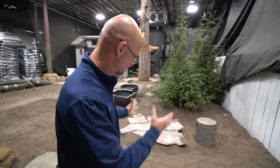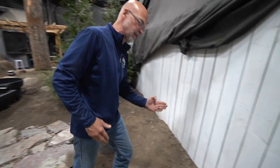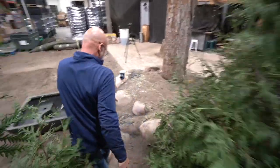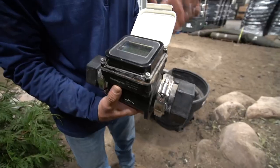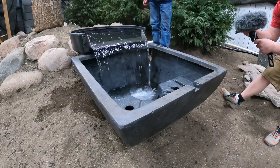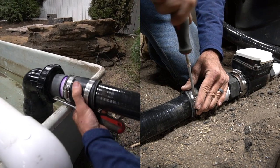Come over here — we have the fence, so I'm going to make another 90 and start coming this way. I'm trying to get over to my Bio Falls, but now there's a patio on the way. So you're working around existing structures. We're going to make another 90-degree turn — there's another large old tree here with the stump still there. We've got to go way past it all the way to the fence, then make another 90 and come this way. We have to weave through these trees as well, and finally we are going to make it into the back of our biofilter. I want to see what type of impact it actually has on our flow rate. Then we're going to do the exact same test using flexible PVC, which uses the same glued-in type joints, but we're only going to have two joints instead of all these 90s and elbows. I'm definitely interested to see how long it's going to take to install it as well as the efficiency of the overall system.